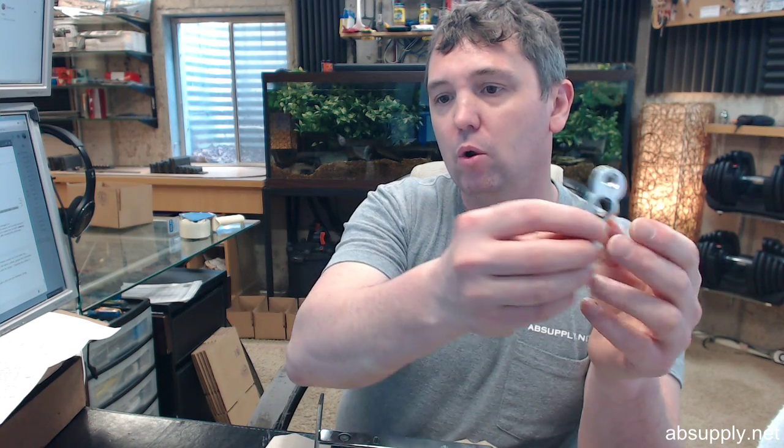It's just heavy on 5/32 of an inch. Just heavy on 1/8 of an inch. You just buzz it in a little bit. Make sure the prep is nice. Then drill your center hole, which they have called out at 5/8 at a depth of 5/8 of an inch. 5/8 hole, 5/8 deep, and that's for the top pin.